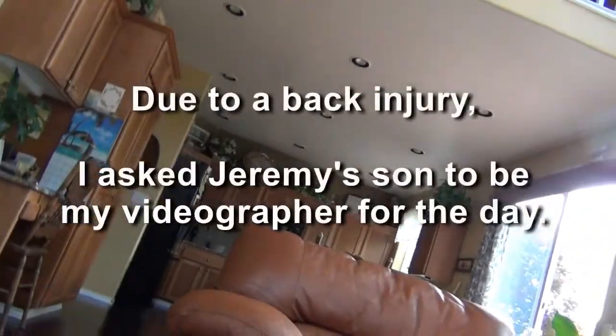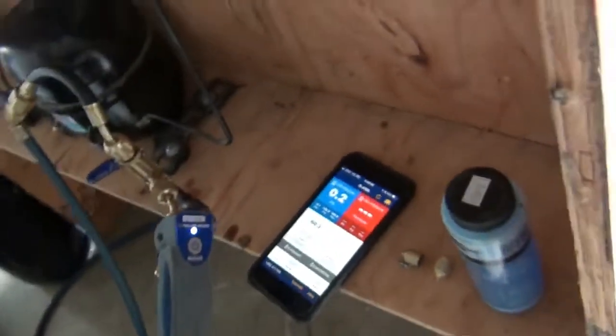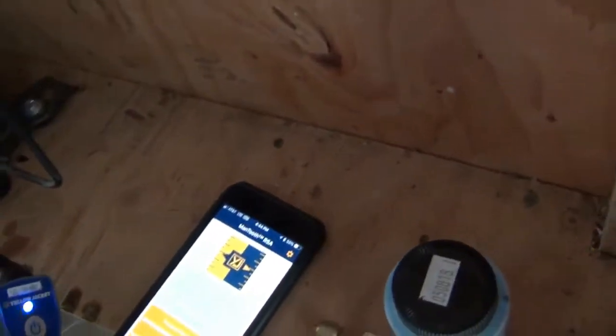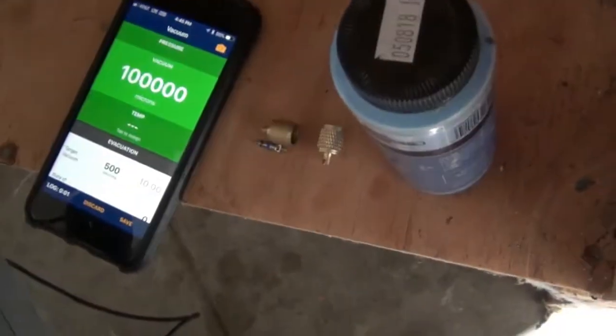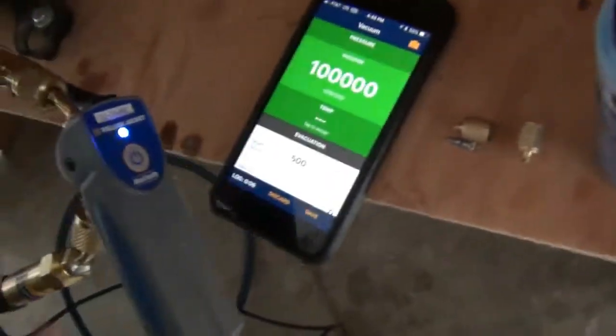It's recording. Okay, so you just put your hand in and film away, be creative, have fun with it. He asked me to film you. Well, I pressure tested it, and now I am going to put it on a vacuum. So we're actually going to pull out of here. Home vacuum — it's at 100,000 microns because there's no vacuum, it's completely open.